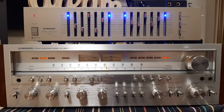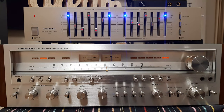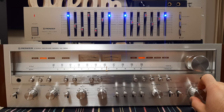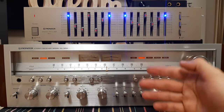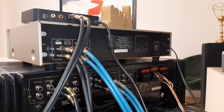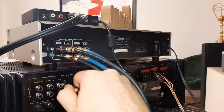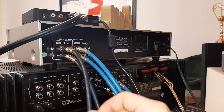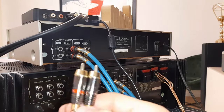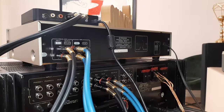To do this, we have to disconnect the sound card from the auxiliary input. We have to change the input of the pre-amplifier because we will create noise. I will put it on FM and reduce the volume because I can't tune to a station without a copyright claim. The idea is simple: the output of the sound card is going to the auxiliary input. We have to take out the sound card cable from the auxiliary input and insert it on the input of the equalizer. So the sound card output goes to the equalizer input.